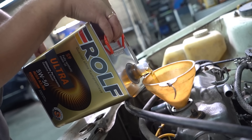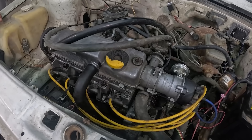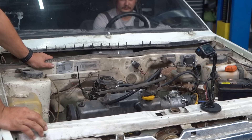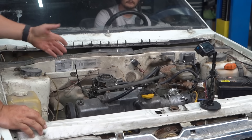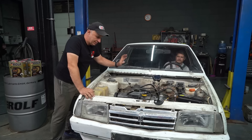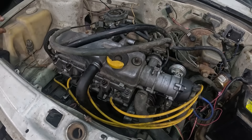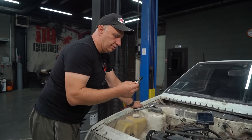The engine with these square pistons has been assembled and installed, and we are about to start it up for the first time. It is cranking — that's a good start. Let's check on the condition of the plugs. Should have fitted two rings; one doesn't seem to be enough. Not super wet, but it is damp.